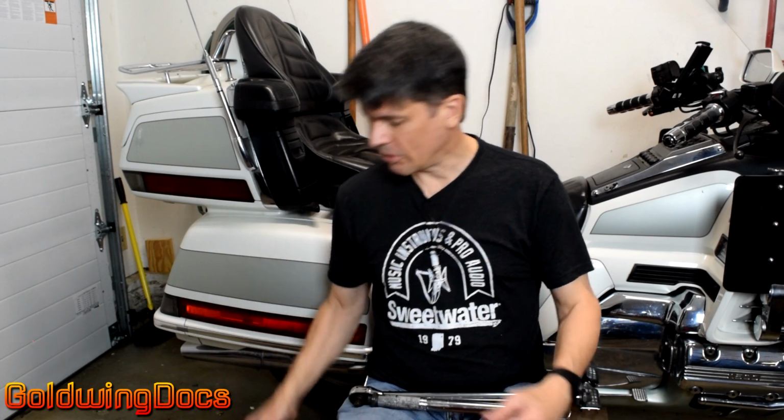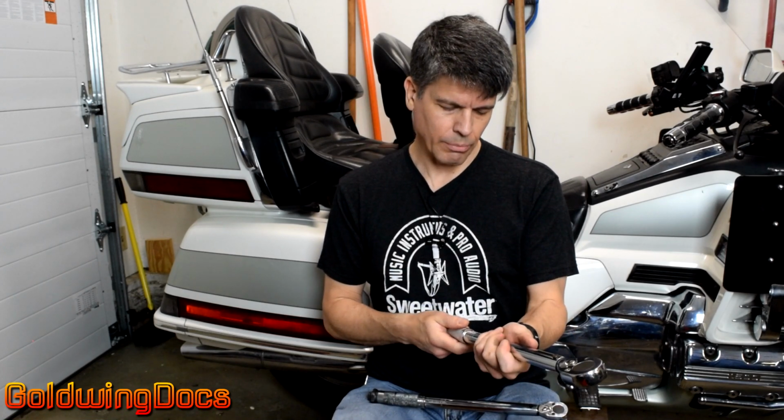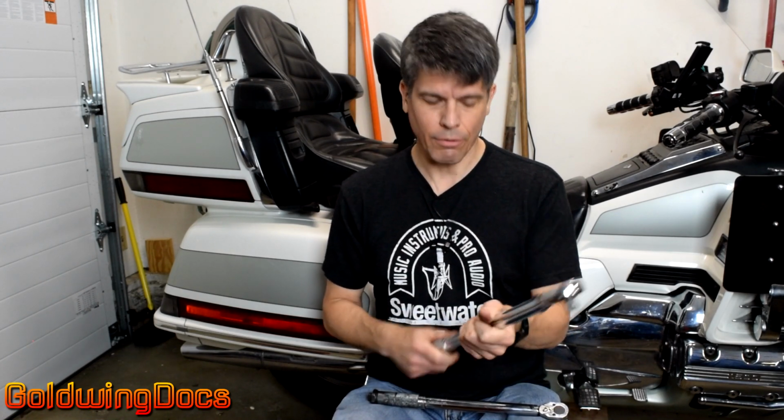Alexa, 200 divided by 12. 200 divided by 12 is 16.6667. There you go, up to 16 foot-pounds. Now the largest one, the 3/4 inch, goes from 10 foot-pounds to 180 foot-pounds.